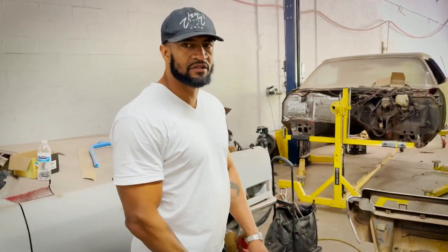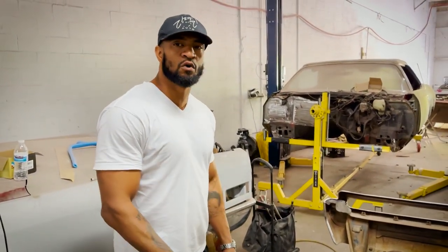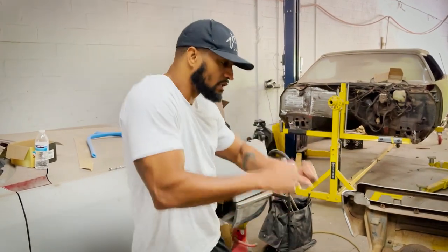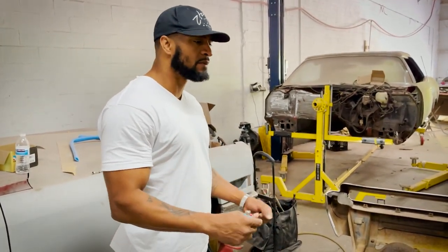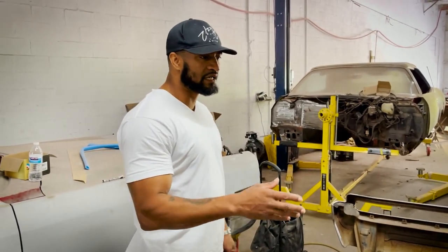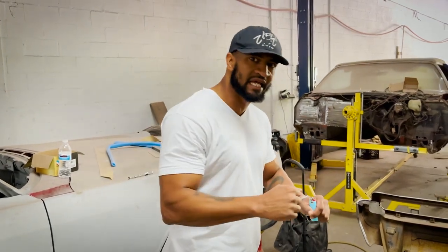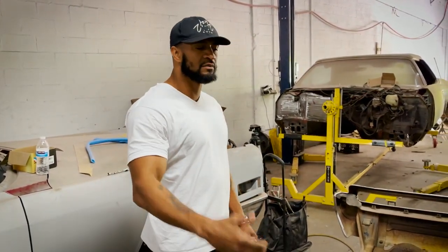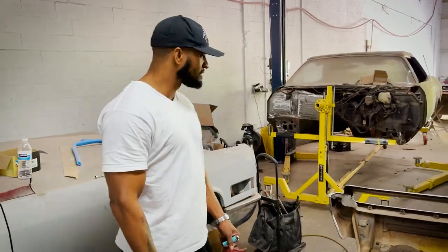If you do things like that and you get to the 1,000 horsepower threshold, you want to make sure, just keep in mind, 600 horsepower was already something. When you get to 1,000, that type of torque is going to put a lot of twist on your suspension components, the frame, the body, everything. So you want to make sure you build it properly to where it's going to sustain. Then a year later, you don't see the doors and everything have gaps, and all of the lines that we lined up are off because of the amount of torque. Every time you punch that gas, it's going to twist. So we're building it to be able to sustain that and have its rigidity in years to come. So shout out to Mr. Rich, man.